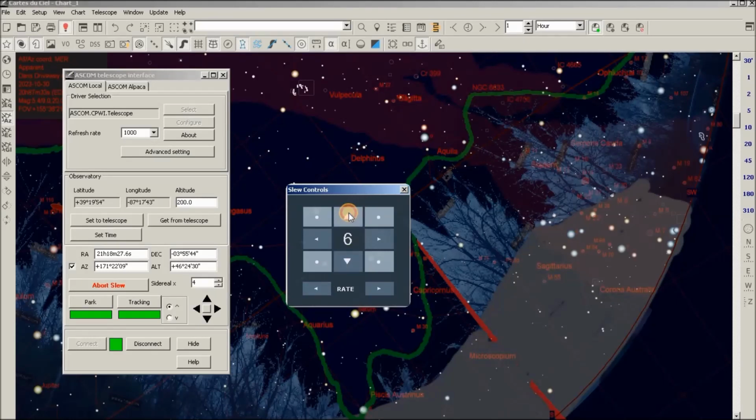I went down south and now I'm coming back forward, and I've got it slowed down. The 9 really gets moving quick. You can see me fumble around a little, trying to get the backlash out of it. There we are. And then I'm going to move back west a little bit. Or east, I mean. And pull the backlash out. Now see, it says where it's at, but it might not be exactly there because there's backlash when you change directions. So this is just where it thinks it is.